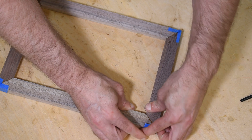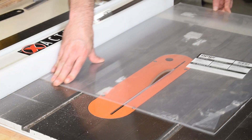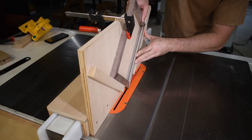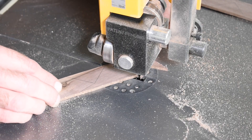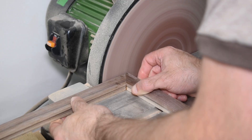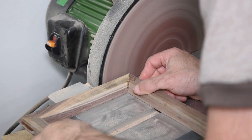The frames were glued and held together with painter's tape. While they were drying, I cut the acrylic and the backer board to size. Once they were dry, I reinforced the frames with splines. I tried to shoot for a slightly loose fit during dry assembly because in my experience tight-fitting splines tend to not fit once I apply glue. I ground off the excess splines, but you could easily use a flush trim saw as an alternative.